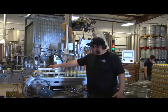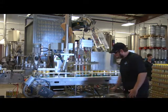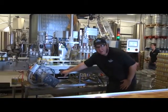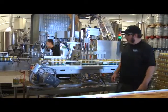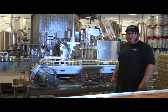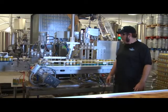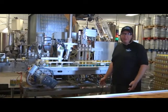As you can see, the seamer sprays beer here. There's going to be beer and stickiness all over all these orifices. You just want to spray surfaces, my bad. You want to spray all this down. You want to get spray inside the conveyor belt here, make sure everything's cleaned out. And then when you get done, you want to just give it a couple looks, give it a once over, make sure there's no beer resting anywhere that's going to dry up, get sticky, attract flies, create mold, any of that. And then the cleaner you keep it, just like anything else in the brewery, the better it's going to work for you.